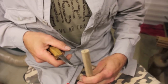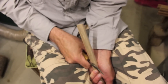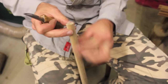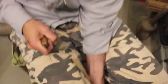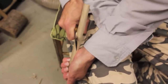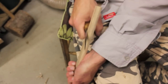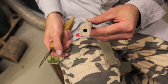The easiest way I find is to work off the side of my leg and pull the knife towards me so I can look straight down it as I'm carving. This is seasoned wood - if you started with green timber you'd find it slightly more difficult to keep the hole straight when drilling, but slightly easier to carve, and you won't really need the glue because the hole will shrink around the tang. Now I'm making an opposite face parallel, going from round to square.